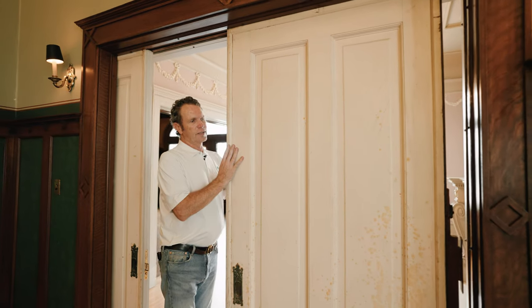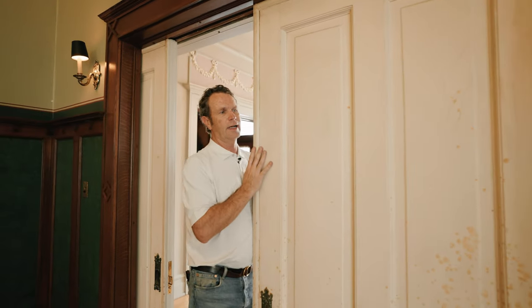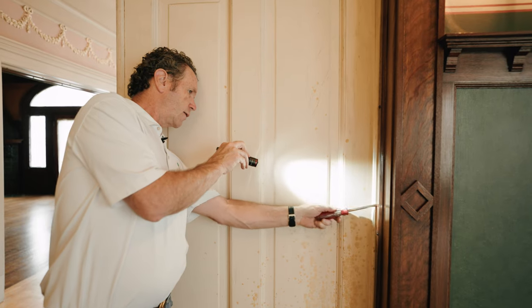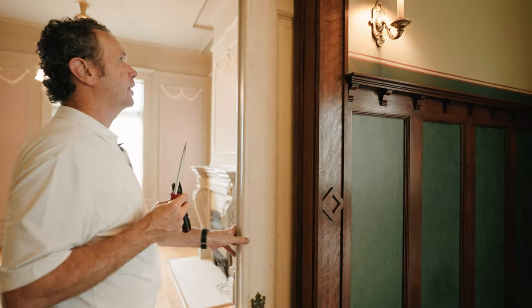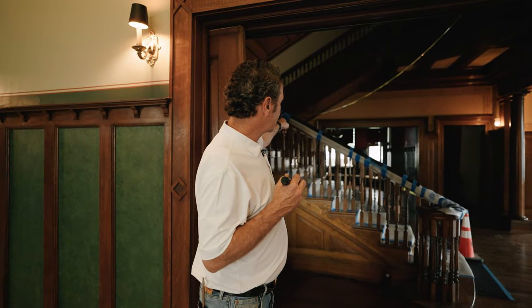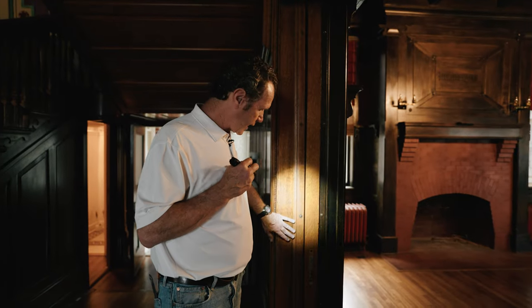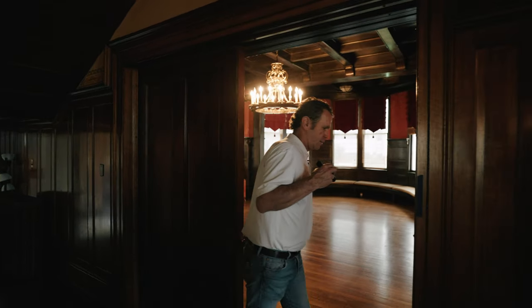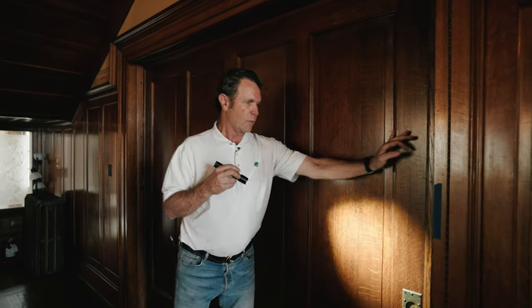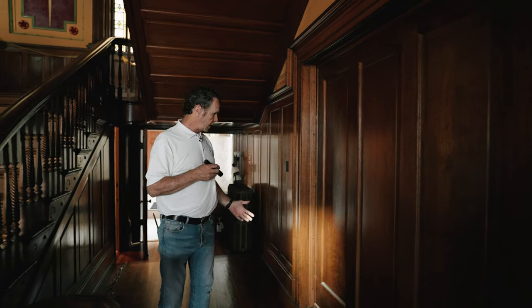Don't be afraid to move these things around. I'm kind of stuck right here, but I know I'm stuck because the tracks were at a different height. I'm going to just lift this up and get it back going again. Remember, I've got my little key piece - all I have to do is touch that bottom corner and I lock that stop right back in place. I've got my stop back in, door back in place, this all working pretty good. That door over there - there's no room for a double pocket door, so I have a single pocket door that goes across the whole thing. What is that, an eight-foot, ten-foot opening? We've got a really dark stain on one side and a lighter stain on the other side, but this door is one ginormous door that opens all the way up across here.